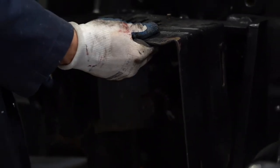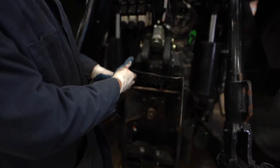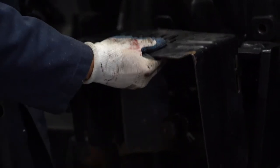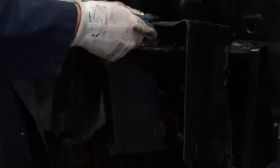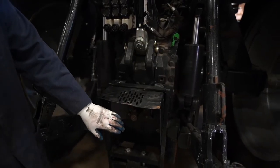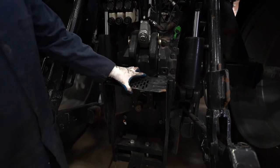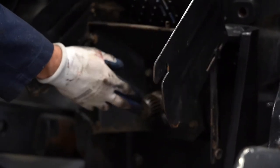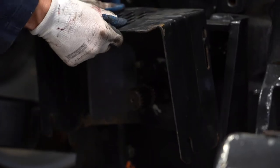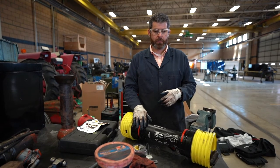This is the PTO master shield — we want to make sure these are in good shape on our equipment and also on our tractors. These are not steps, and you want to make sure they can be serviced and replaced if needed. Sometimes they get bent from a tight turn, so the PTO-driven implement can cause damage — make sure they're checked as a pre-season inspection. Your PTO stub connects here and the master shield on the tractor guards that knuckle as well. Thank you, and I hope you enjoyed the video.